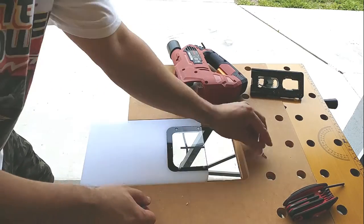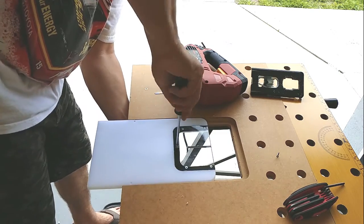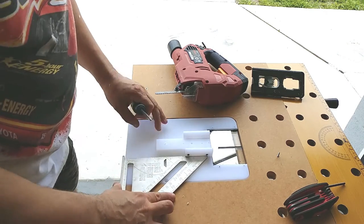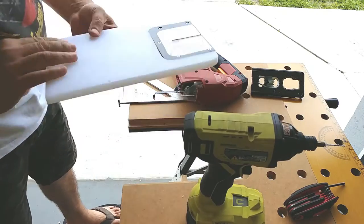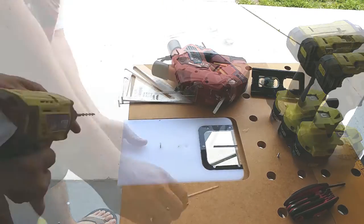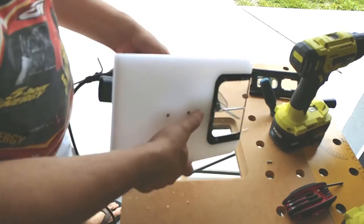To mount it, I started with a small pilot hole about a quarter of an inch from the edge. I then removed the screw from the center of the clear window and replaced it with a longer one. With the spacer secure, it is just a matter of flipping the scroll saw conversion plate. To mount it, I am drilling through, countersinking, and mounting two more screws. The same goes for the mounting screw holding the jigsaw in place — drilled a small pilot to verify placement, drilled, countersunk, mounted the jigsaw, and that is it.